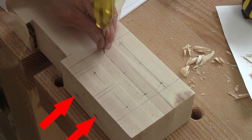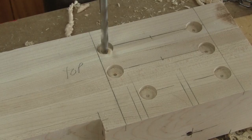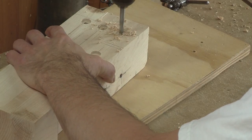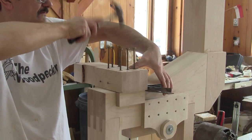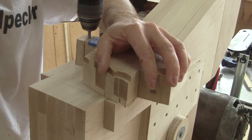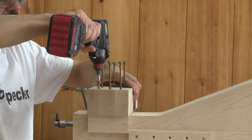I take care to avoid the holes for the guide. I begin by drilling some big shallow holes for the screw's head, then the true holes. Now, with the support in place, I can mark where the holes will end up on the frame. To drill straight holes, I make a guide again. Then I can drill the six pilot holes.